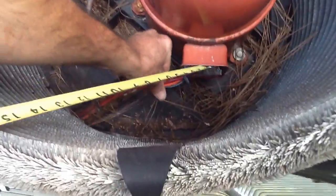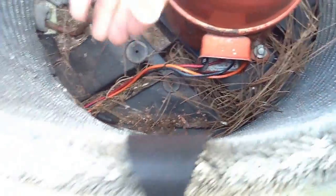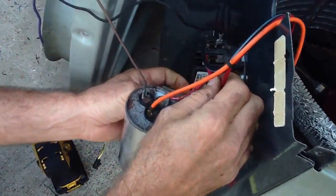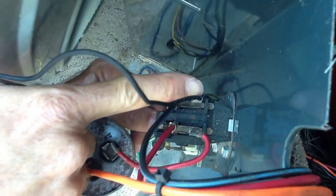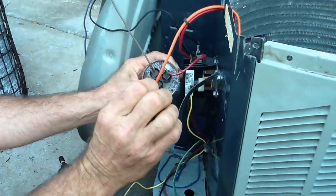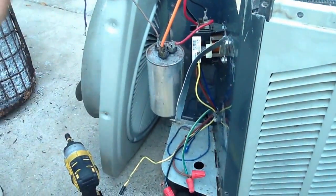We have three wires coming off this one — in this case you have orange, red, black, and blue stripe. Notice once again your red wire is on your T1 side, and you have another red wire matching. You have a black and blue stripe wire, and also a black wire going to the fan. Your hermetic wire — the start winding — is orange on the H side. You always have three wires: one on the start winding, the red on T1, the black on T2. That's all there is to it. Any questions, call Jones Air Conditioning Electrical at 239-596-5855.